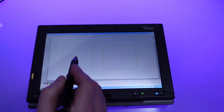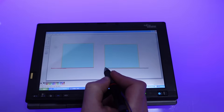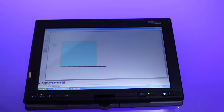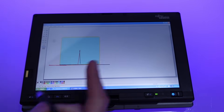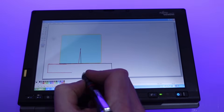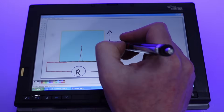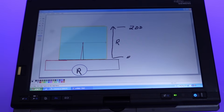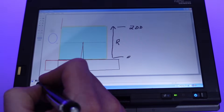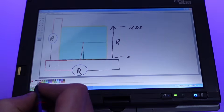Most importantly, we need to add some spacers to prevent the two sides touching accidentally. Now if we connect a wire along the bottom edge of both layers and put the two panels facing each other, pressing down on the top layer will allow the current to pass between the two wires. Measuring the resistance will give you the position on the Y-axis, the resistance increasing as we go further away from the wires and decreasing as we come towards them. Do the same for one of the sides and we now have an X position.